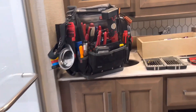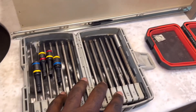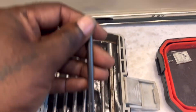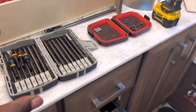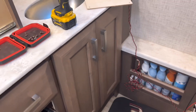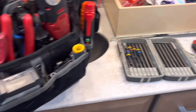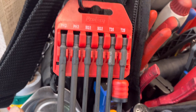Here's my setup - I've got my electrical bag on the counter, my bits and kits. I had to remove panels using the Blue Point set. These bits are pretty good except the number two Phillips - I've ordered a Snap-on to replace that, and I've already replaced the number one square with a Snap-on. The number two Phillips isn't shaped properly, doesn't make good fitment with a number two Phillips screw, and it slips. You don't want that to happen - if it slips and damages an adjacent surface, you get to buy it. I also have some Amazon bits and the Phillips fit very well on those.